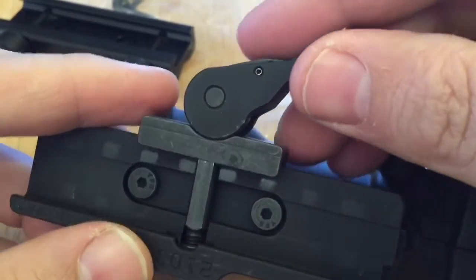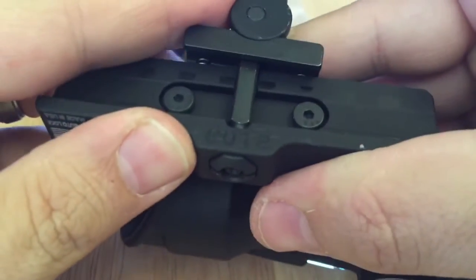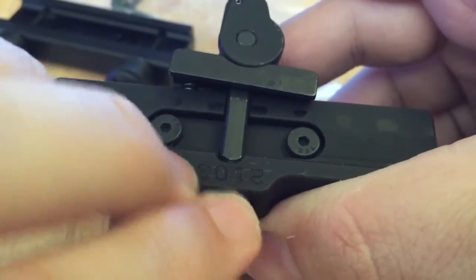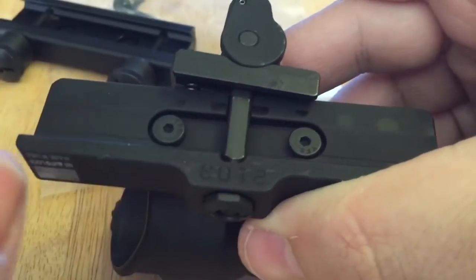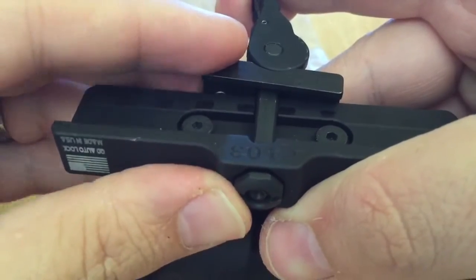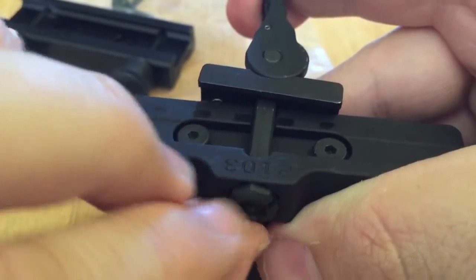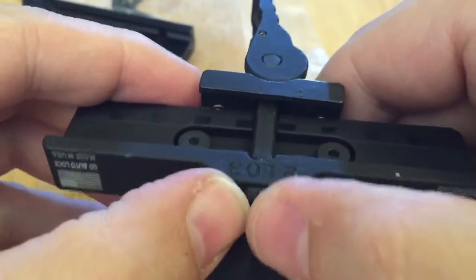You can adjust the tension by pulling this lever out to about a 45-degree angle and pushing in on it. When you do that, this nut comes out on one side, and you turn it — counterclockwise to loosen the tension or clockwise to tighten. The drawback is that the only amount of movement you have is one flat side of the screw at a time, so you can't really put it in an in-between position. You have to use one of those settings so that the nut recesses back into the body of the mount.